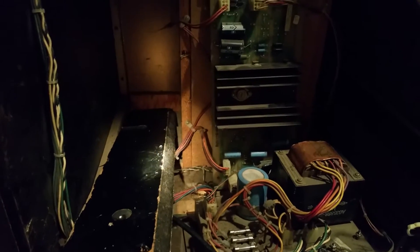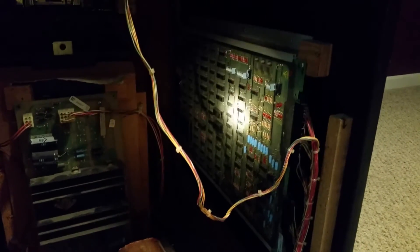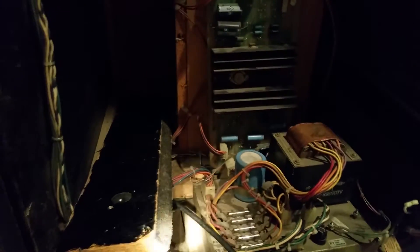I do make reproductions — I'll have a video on that sooner or later. I've also fixed my CPS2 boards for my Marvel Super Heroes machine. I have a bunch of those boards; some of them were fried. They're called 'suicided' — the battery dies out and it's supposed to keep the board from being played or pirated. I'll go a little more into the history when I do a video on that, but this is what it looks like.